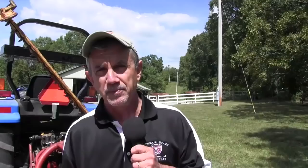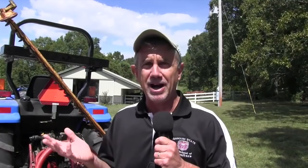There are a few new ones out there, which may be worth looking at. The second thing I hate about a sickle mower: if you're buying it to mow hay, in really heavy hay conditions it can take all day because you mow a little while, it goms up and just packs full of hay. You have to back up and go forward again, and heavy hay conditions are horrible. A disc mower is much, much preferable to mow hay with than a sickle mower.